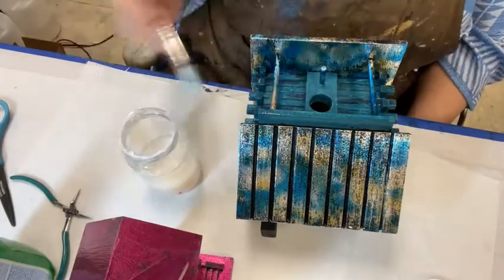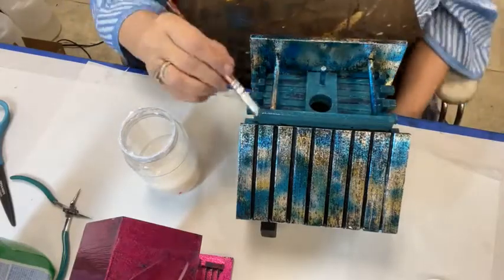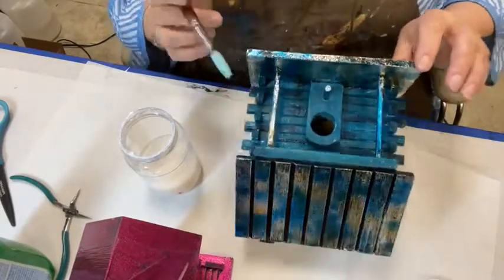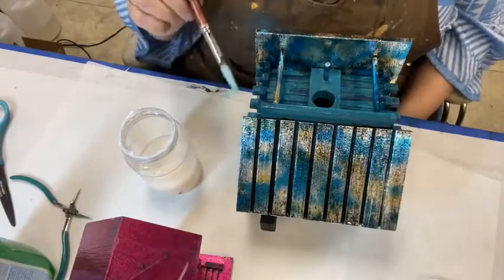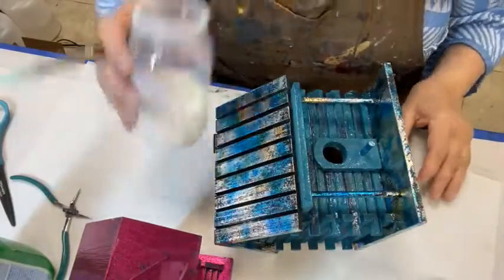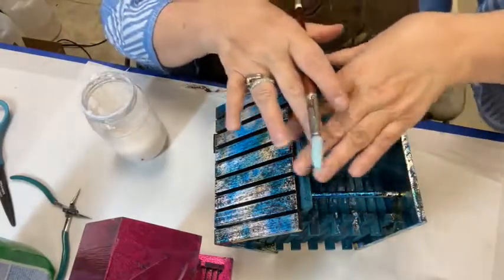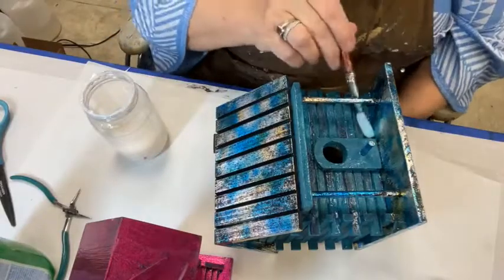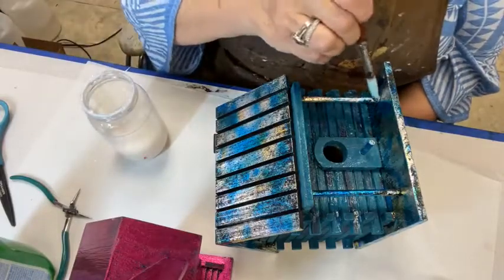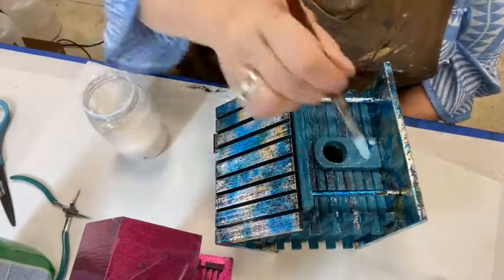I've got to work to get some top coat on under here. Now I'm making this whole thing glossy, but if I wanted the stained body to be duller, I can step down my top coats — first apply gloss, then satin, then dull. What that does is allow the matting agents to disperse evenly without causing clouding, fogging, or blushing. I'll decide tomorrow if I'm going to step down the shine.